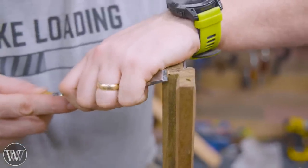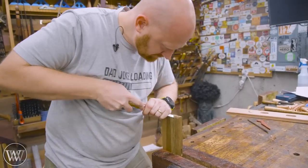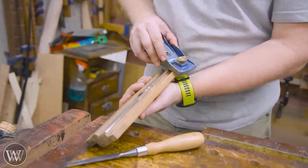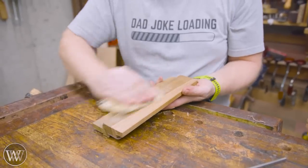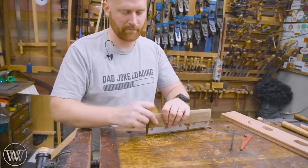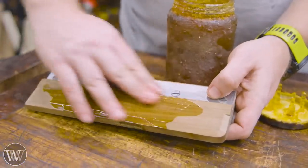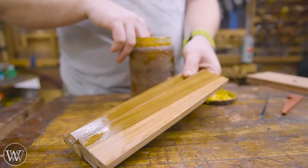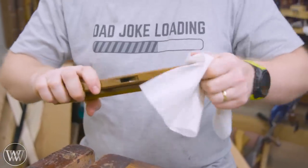For the last details, I'm putting in small chamfers on all the corners, feeling with my hands for any issues or problems. I was thinking about putting some carving on the side but decided not to — maybe in the future. Then I hit it with some 400-grit sandpaper — not really sanding so much as working a little dust into the surface to help the boiled linseed oil soak in more. Because it's a hand tool in my shop, it's getting coated in boiled linseed oil; I let that sit, wipe off the excess, and apply paste wax. All the hand tools in my shop are finished with boiled linseed oil and paste wax.